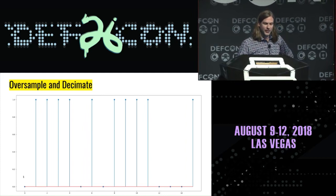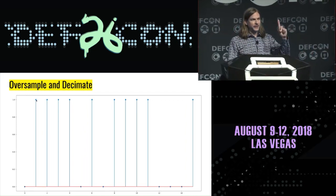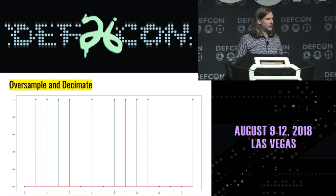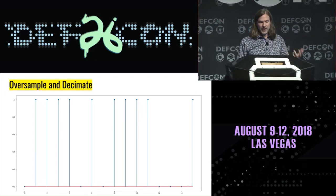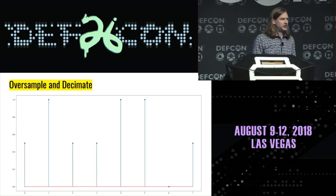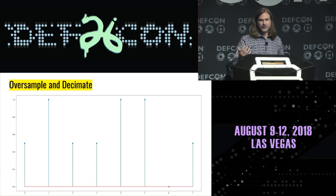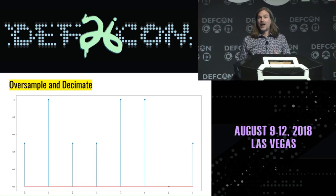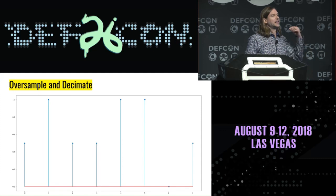So those first two samples, 0 and 1, we combine into one sample that has a value that's the average of those two, so it has a value of 0.5. And I'm going to do that with every pair of samples. If I do that, then I turn my sample stream into this in the digital domain. Instead of having zeros and ones, now I have zeros and ones and one halves, but I have half as many samples. But I've added more dynamic range. There's more nuance to the vertical scale, and I can keep going.